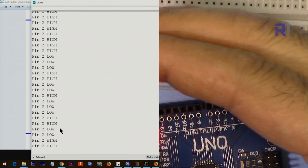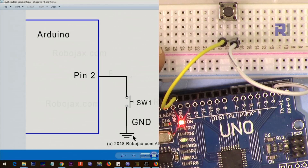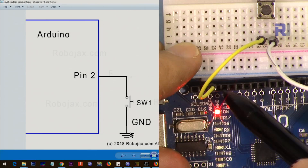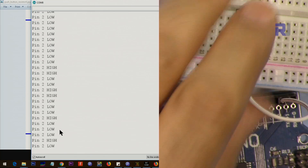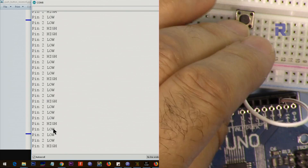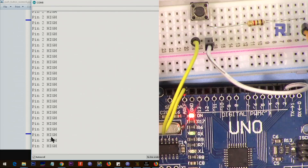Now this scenario: the push button is connected between pin 2 and ground — pin 2 on one side, ground on the other. The reading is low, but there is noise; if I touch the wire it becomes high and low randomly. To make the input immune against noise and make it stable, we need to put a resistor so it can work properly. Now I have connected the resistor to 5 volts — by default it's always high and never changes even if I touch it.